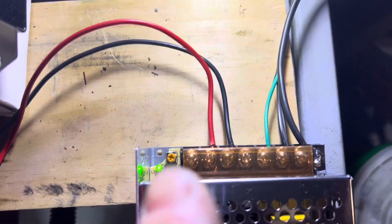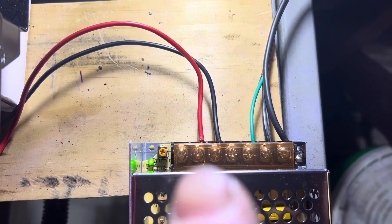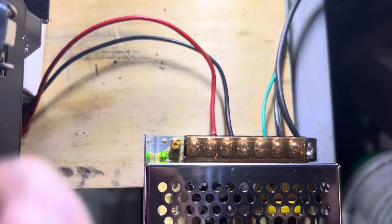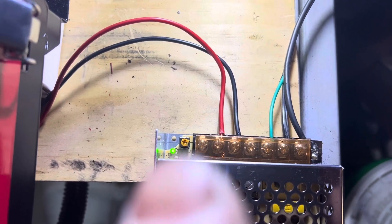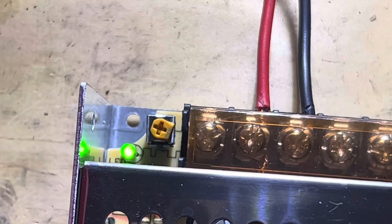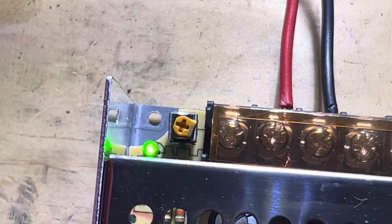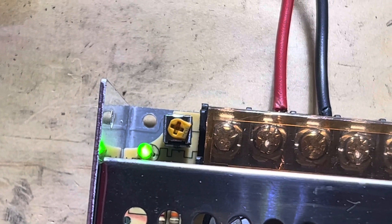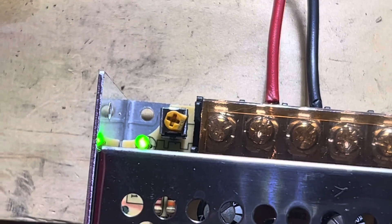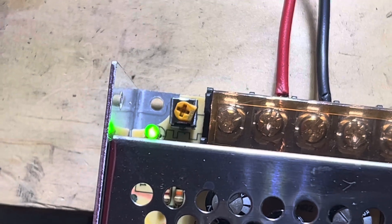Right out of the box these are putting out 12.6 volts. Some of you may not know, but if you look on your PC board, all the way to the left — you've got all your terminals where your wires come in, the AC in and ground, and then the voltage leads that go to the heater. There's a little yellow pot down in the bottom left — I'm going to zoom in. It's called a pot, a little adjustment pot, and it's used for adjusting the voltage that the transformer is creating.